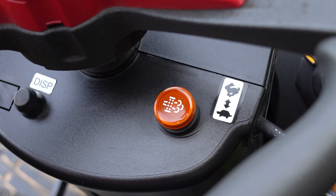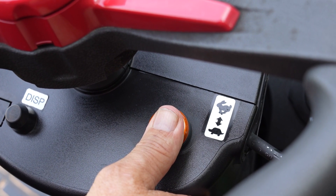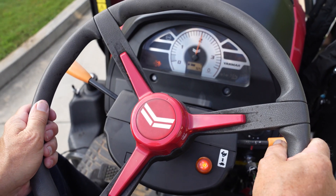Reset is the first strategy of regeneration that requires the operator to perform actions, so simply press and hold the button for about five seconds. Once regeneration starts, the regeneration notification icon and initiate regeneration button will stop blinking and remain lit until complete.